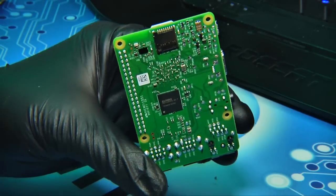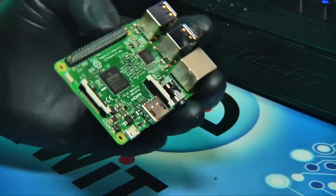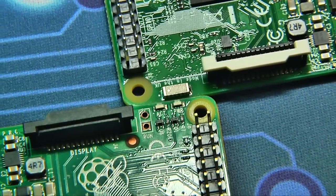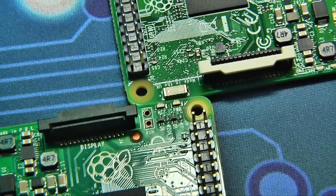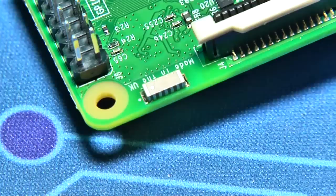It's not just processors. The system on chip — the Broadcom — has changed to support different peripherals. Rather than having to use a USB dongle to get Wi-Fi or Bluetooth, it's now on board. If you look right here, you'll see one of the few physical changes on the board: where the LEDs for power and activity used to be, there is now an on-chip antenna that gives you Bluetooth, Bluetooth LE, and 802.11n Wi-Fi connectivity.